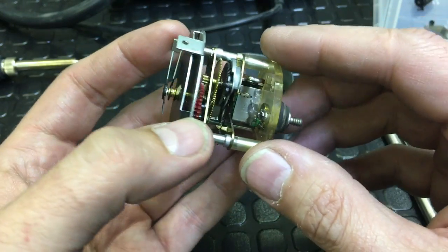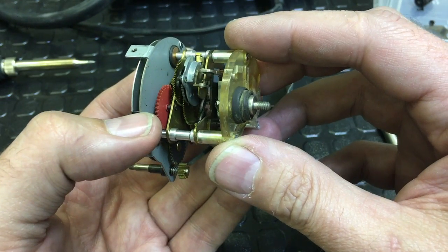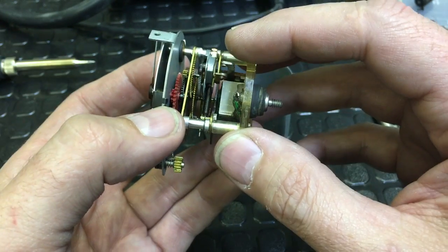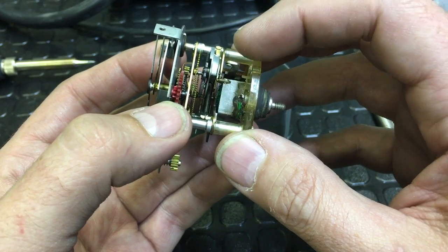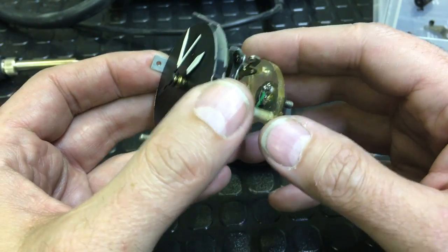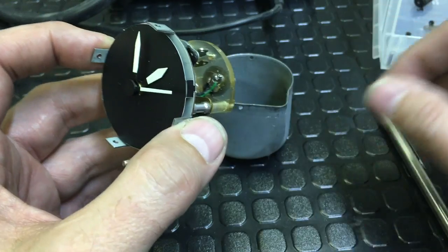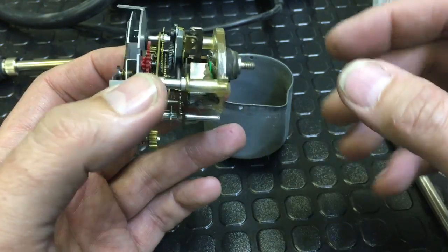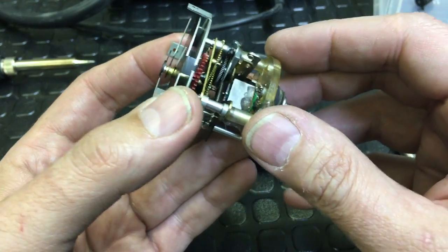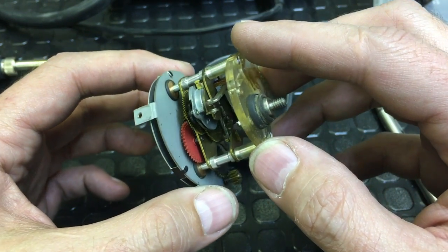So this clock goes through this cycle about every 45 seconds to a minute — the solenoid energizes, slams the winder down, it goes back up, and it just continues to do that. I bet if you put an ear to this and it was really quiet, you would hear it — if you had this same clock in your aircraft, or even some old cars have a very similar design — you would probably hear about every 45 seconds to a minute a click, and that would be the solenoid winding the movement.